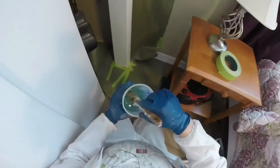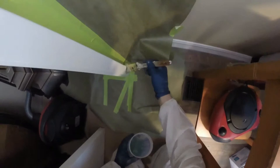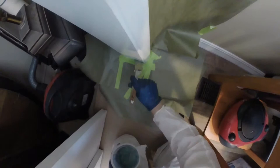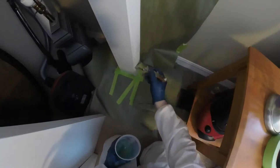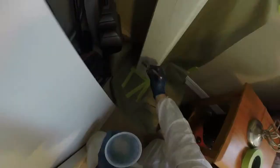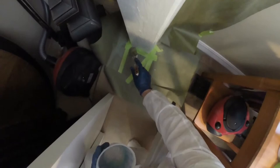So what I'm going to be doing is working from the bottom to the top. I'm going to pay special attention that the paint stripper does not pool down near the floor. We don't want paint sitting on top of our masking paper here. I'm going to try to put it on fairly heavily, and we're going to let it sit for about 24 hours.